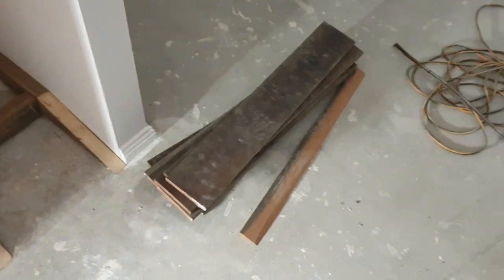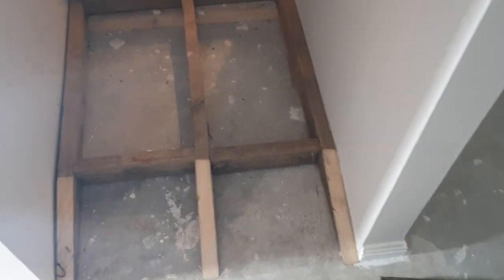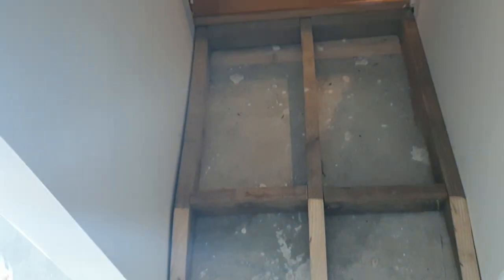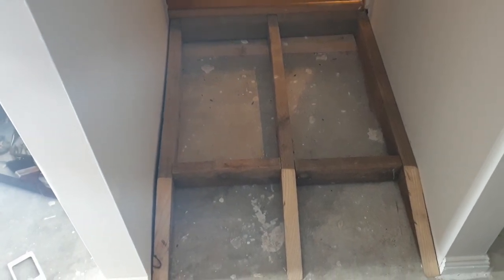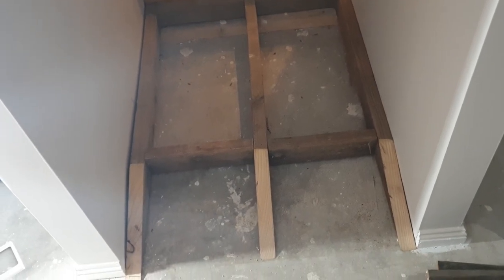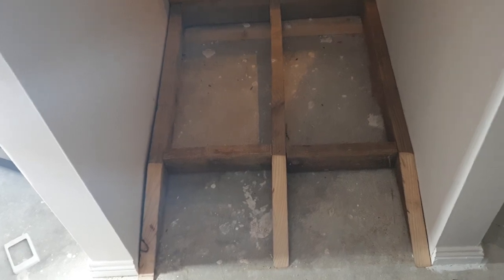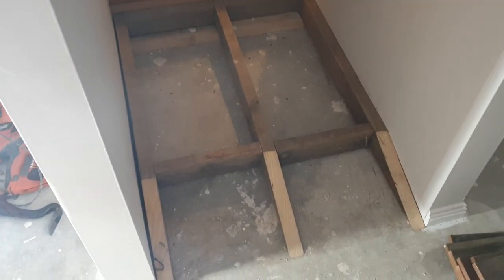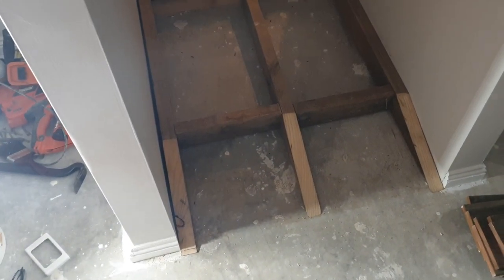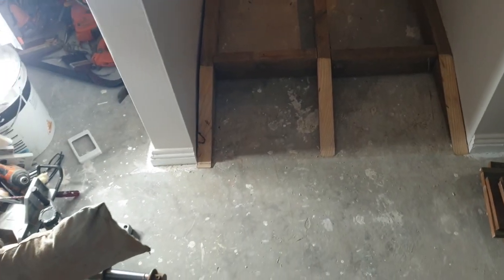Here are the bare basics — our little bits and pieces. What we do is make a frame up, and we still bracket these sections to the bearers on the bottom. We've got studs coming down the sides, so we'll come into the sides with studs and then bit by bit we screw these boards down. We normally go hard on nail guns, but with these boards you don't — you pre-drill them, because they'll split unless you pre-drill and screw. That's what happens, and we had to decide on a point.